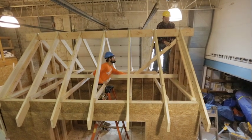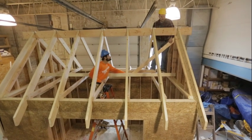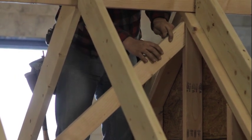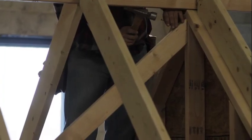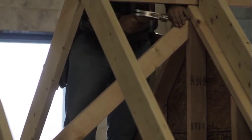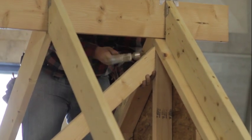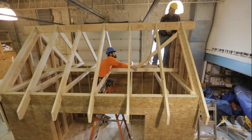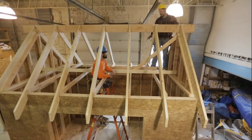We're ready to put this angle brace into place. I'm going to nail it at the top with a 16-penny nail, coming in right at an angle to tack it into place. It's a little bit of a difficult angle, but you just got to get it in there.